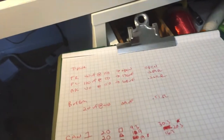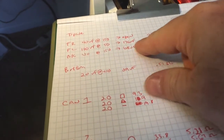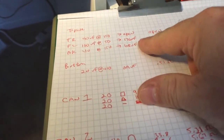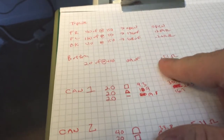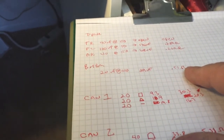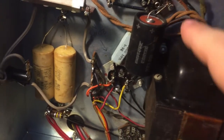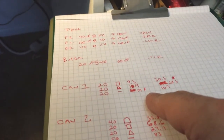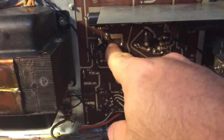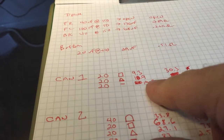I finished testing all the electrolytic capacitors. Starting with the top side, one capacitor was completely open. Another was reading substantially off. On the bottom I found a 20 microfarad capacitor which turned out to be a replacement as part of a multi-can capacitor that had gone bad — this is part of a prior repair. One of the 20s was bad, and you can even see it was labeled '20 NG' right here. There's a smaller can capacitor located right here on the circuit board — it has all 20s in it.